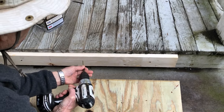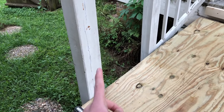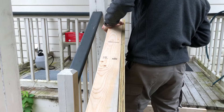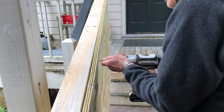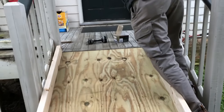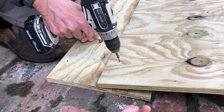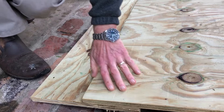With this board in place, we need to get the two-by-fours in — they're gonna support most of the weight. We're going to do one six-foot strip and one two-foot strip going down, and we're about to go cut those now. We're about to screw on the first six-foot strip two-by-four right up the plywood. There's the first little strip of it — a little scab — and we're screwing it on. There's one side of it.